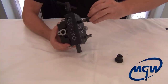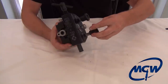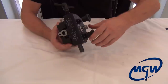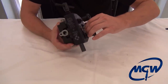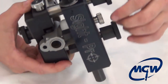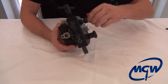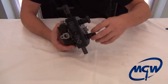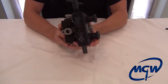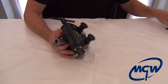This is one of the slides where we need to adjust the Delrin pad a little bit because it has a raised post front sight. Turn this until you just get some clearance — it's very easy to see when you have clearance. Get these close. Before locking it down, you just loosen that, move the slide and lock it down so you can access it easily.